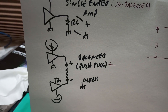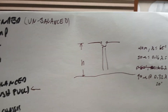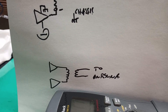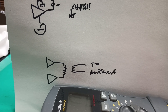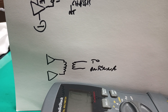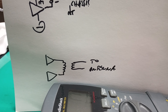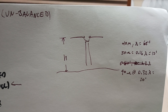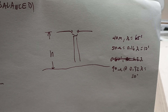So why is everyone stuck on using baluns? The reason is that in the old days of tube amplifiers with output resistance of several hundred to several thousand ohms, you couldn't use 50 ohm coax. High resistance twin lead was used — but that doesn't exist anymore except in rare exceptions. The standard is 50 ohms. So everyone's making 50 ohm dipoles and they won't match, because they're falling for another old ham myth called 'higher is better.' Higher means more transmission line loss and much more difficulty in installing the antenna at height.